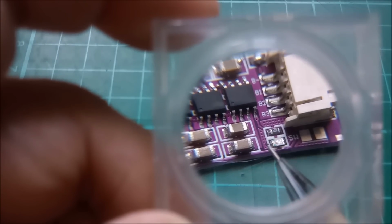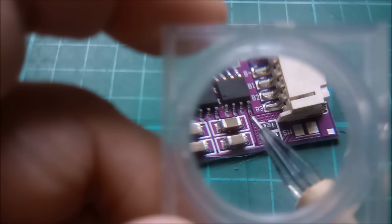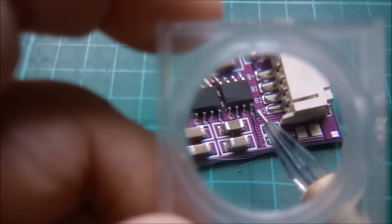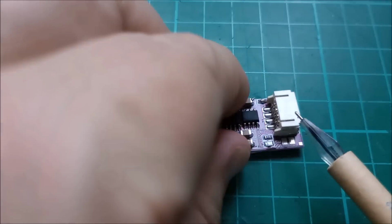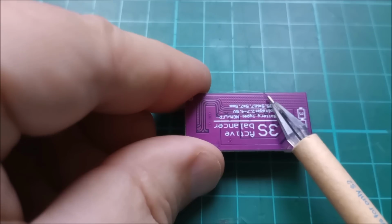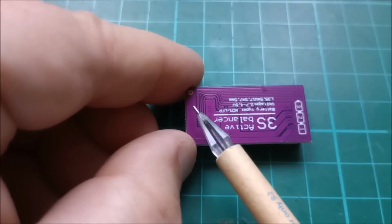Yeah, I think you can see, or I hope you can see, the LED has a little via there, and the resistor has a via up there, but it's actually connected to this MOSFET. I think that might be a source pin. But this via here next to the LED, if we flip it over, it runs along this track at the top and goes out to this point here, which is 0 volts.